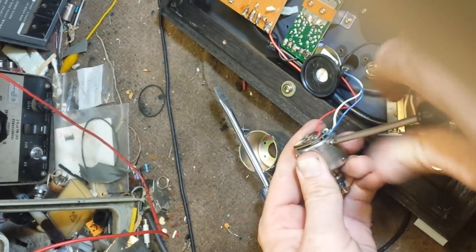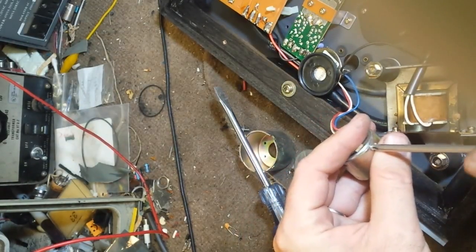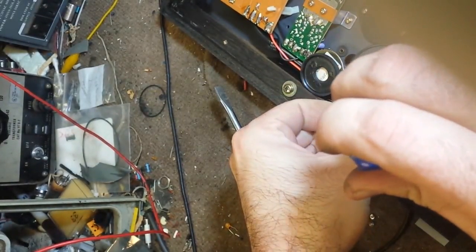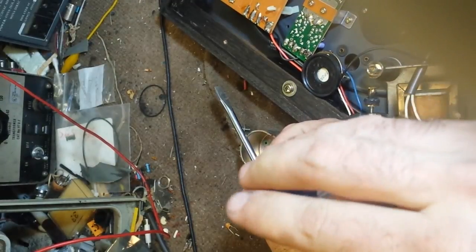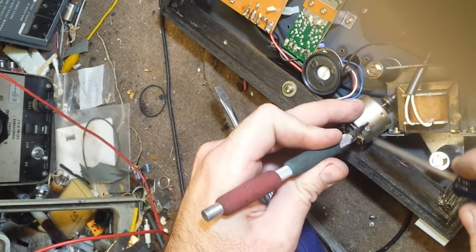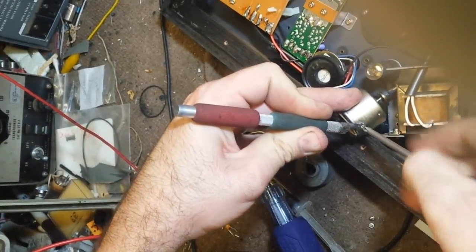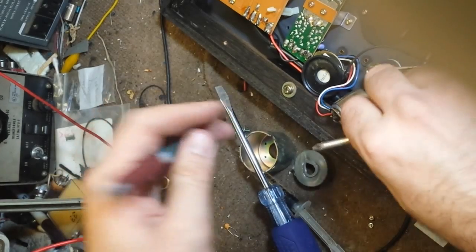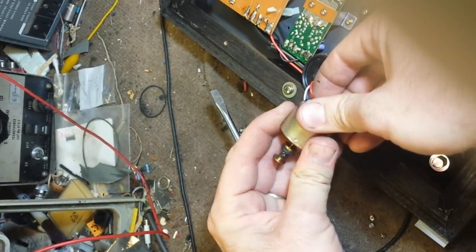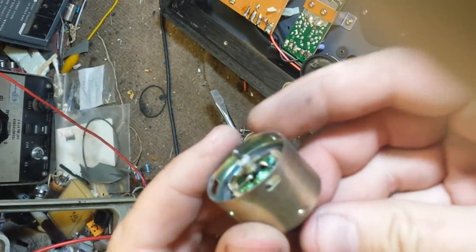You can try adapting a motor to it on a fixed-rate power supply, or designing your own servo — whatever you want to do, you can do it. But it seems to me to be a waste of time unless you really love this turntable. This screw doesn't want to come out, so I'm going to try an X-Acto knife underneath the screw as I turn to get it past the stripped threads. So let's wiggle this loose — there we go. So there is your bottom bearing that has your brushes.